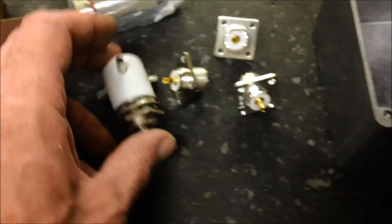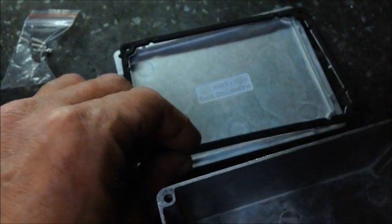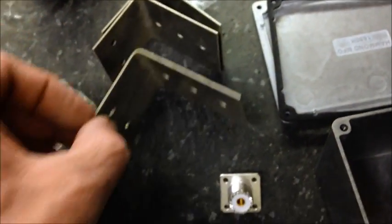I'm going to activate this - it's a 12-volt relay - so I'm going to hang a connector out the end to power the relay. I bought a weathertight box because this is actually going to get mounted on the tower outside. It's got a little gasket that comes with it - you take the sticker off and it sticks right to the lid so if you ever have to service it. I've also got these L-brackets - they used to call these party wall clips - one I'm going to drill out to hold the relay and the other two will be on the box itself.